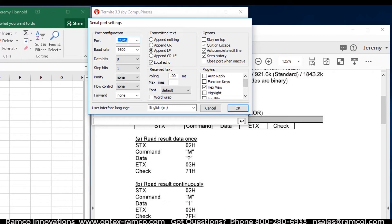If you aren't sure which COM port to use, you can go to device manager within Windows. Termite only allows you to pick the active COM port, so it makes it easy if you only have one or two to choose from. I set the baud rate to 9600. The CD5 laser is at 9600 baud for the first 5 seconds after warm up and then adjusts to the baud rate stored in non-volatile memory. The default is 921.6K. I sent a command to the laser to go to 9600 for this tutorial.